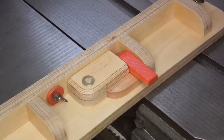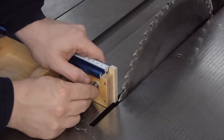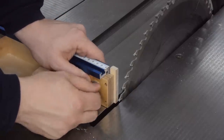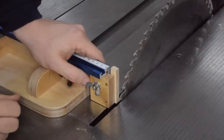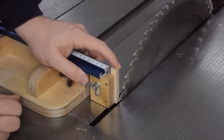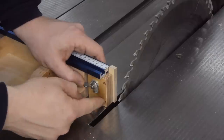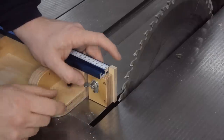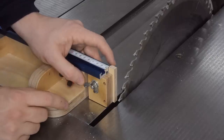It's actually pretty simple. The last feature is the movable zero clearance pad. When the sacrificial part is damaged or cut away, for example by a wider blade, this can be moved in towards the blade a couple of times. And when it's completely spent, I can remove those two screws and replace it with a fresh strip of nine millimeter birch plywood.